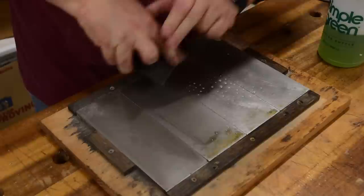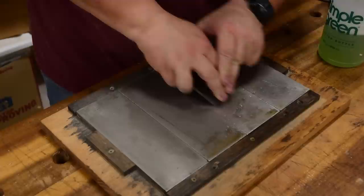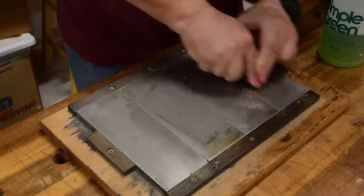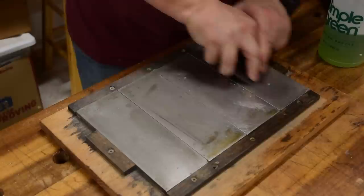I'm adding the slightest of camber — not much. Come back over to the 4000 grit: all pressure over here, all pressure over here, then a little pressure in the middle. At this point I'll feel for a burr — I have a slight burr all the way across, so I come over to the highest grit. This side, this side, and then in the middle.